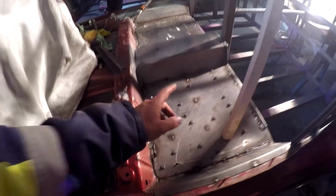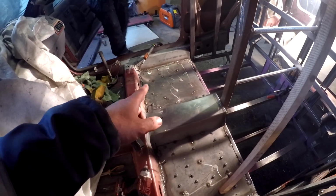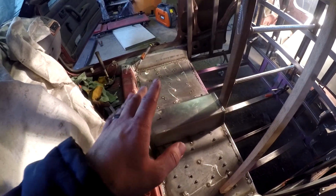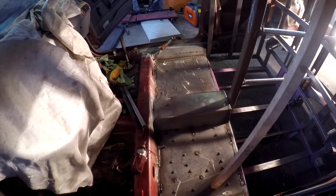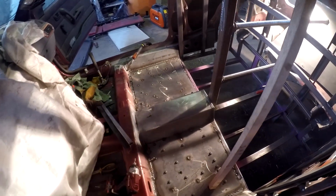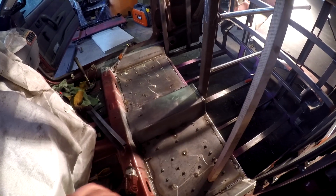And it actually has two sets of 1mm steel, and the original had 3. So this is a little bit not as good as the OEM floor, as we wanted to make a new one, because the old one was so rusty. We wanted to make a new one, but we don't want to make it with any less strength than the OEM style.